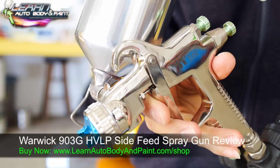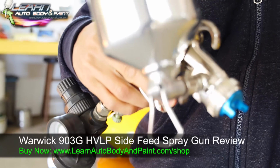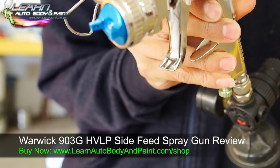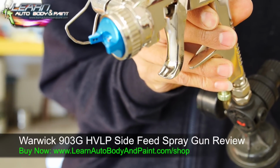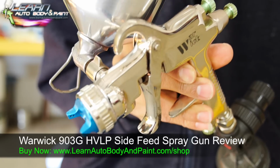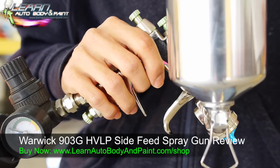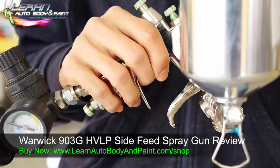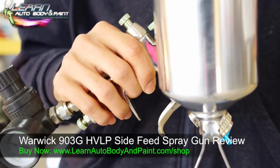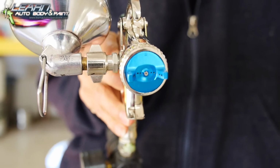So this spray gun is an awesome little spray gun. It's a side feed, like I said. Here we go, the 903G. We're looking at an operating pressure of 10 CFM at 29 PSI for the G model here. They also have an H model where it comes as a siphon feed, and I'll show you that in another review. You can get a 0.8, a 1.1, a 1.4, and a 1.8 size tip for the front here.